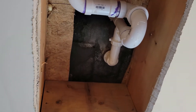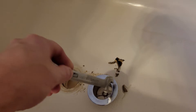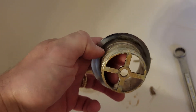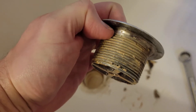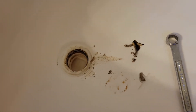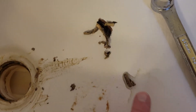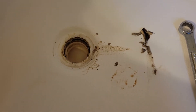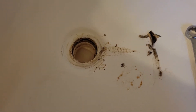I'm kicking myself a little bit because after some research on YouTube, I found out that all I really had to do was take this piece out of the drain. Pretty simple — you put a tool in there, use your vice grips, and turn it out. It pops right out easily. What you're supposed to have is plumber's putty on this inner corner edge all the way around, and when I opened it up, there was only a tiny bit left. I don't know if that was a bad install or if plumber's putty deteriorates over time, but I didn't have to make both holes in my drywall.